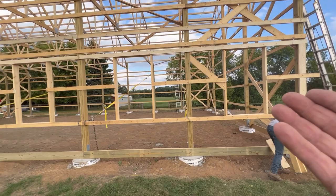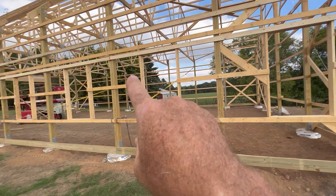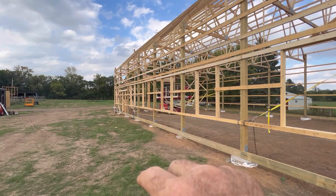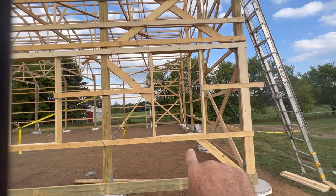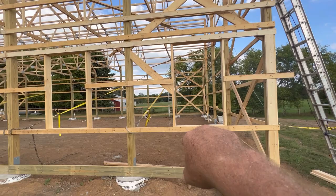On this side, which is going to be facing west, we've got a window now cut into each one of the bays, and the second bay over has a door in it. We ended up adding a second girt here just to catch the top of the window, so we've got one girt that we cut out and then we use this one for the height of our window — that's what made the most sense.